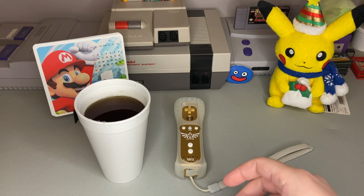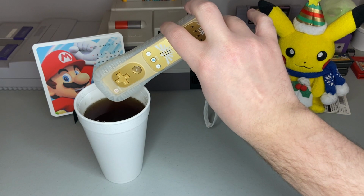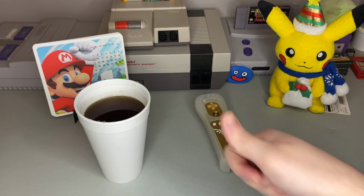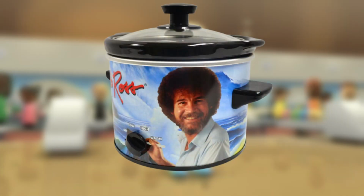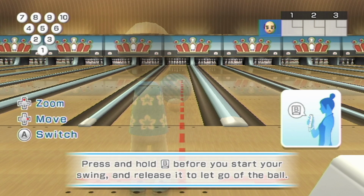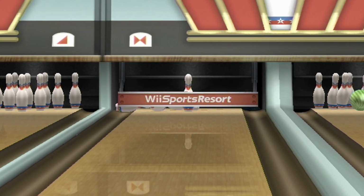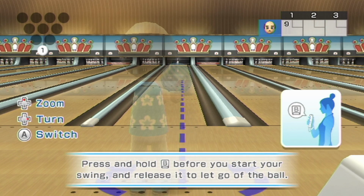moisture, which would mess with its accuracy. One way to fix this is to have the casing absorb moisture from the get-go, so it's stable and retains its accuracy, but accomplishing this proved difficult. The team tried stuff like boiling the circuit board, which doesn't sound like a super great idea to me. They even bought a pressure cooker with company money to test if that would work, but it obviously was not practical. In the end, they just put the circuit boards in a room with a humidifier and a heater for 48 hours until they were stable. It seems to me like that probably should have been the first approach to the problem, but who am I to question Nintendo? And with that, we've pretty much gone through the entire interview.